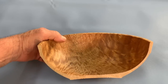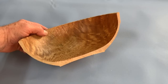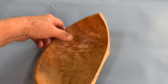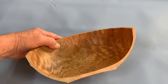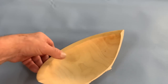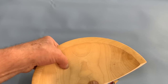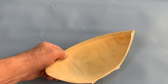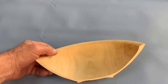Here's a really nice mango bowl which I cut in half — and a lot of you will be thinking, oh, this is almost criminal to do something like that. If you want to do something with it, you just stick a back on it and hang it on the wall. And if you know you're going to cut it in half and hang it on the wall, you might want to remove the foot and just keep it rounded on the base. Here's one which didn't feel quite so good — just felt, where my thumb is, a bit flat. It's not really that bad, but it just didn't feel quite right, which is why I cut it in half. It really pays to cut a few in half — the good and the bad — because you learn so much from doing that.